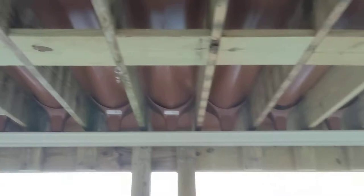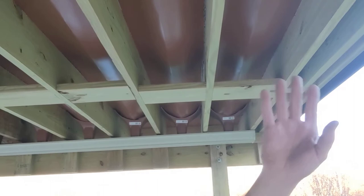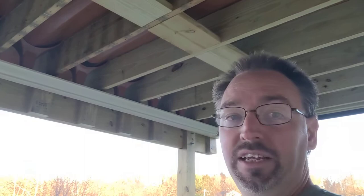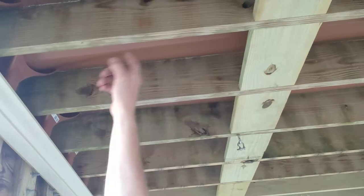We've got these funnels all the way across the entire deck system. The rain escape is pretty cool the way it ties in — we actually flash that into the house so the Tyvek comes down over that to ensure all the water winds up in those funnels. One of the next projects is putting up some sort of a beadboard ceiling and wrapping in a faux beam down each side, giving us something continuous to run that ceiling into. We'll also put some provisions in for electric, a ceiling fan, lights, and motion lights out back. We'll wrap in the gutter and the front bead in white Versatex and put white vinyl soffit on the outside — that way you can take it apart and reach in to clean the gutter or shoot a garden hose up the troughs.